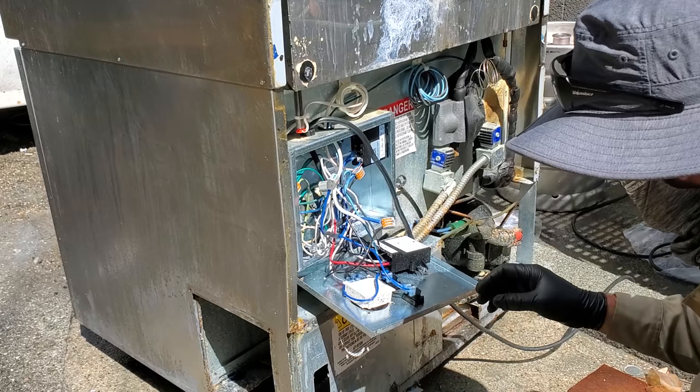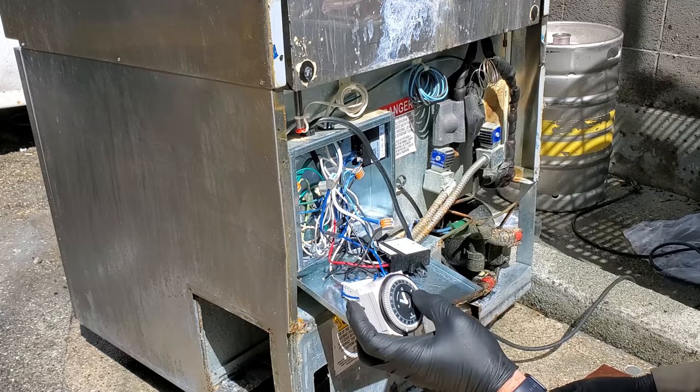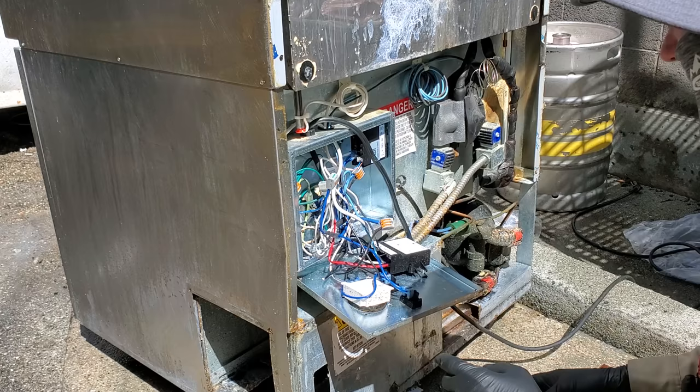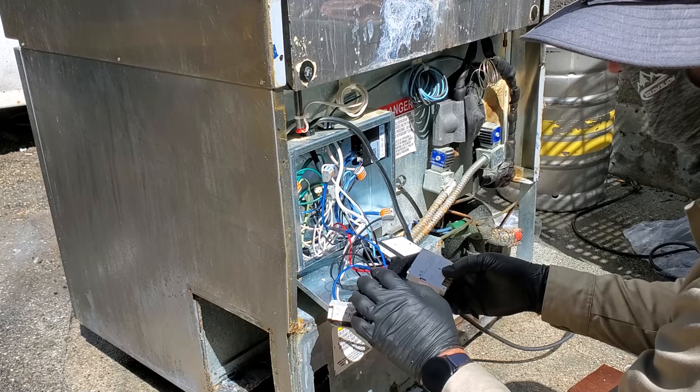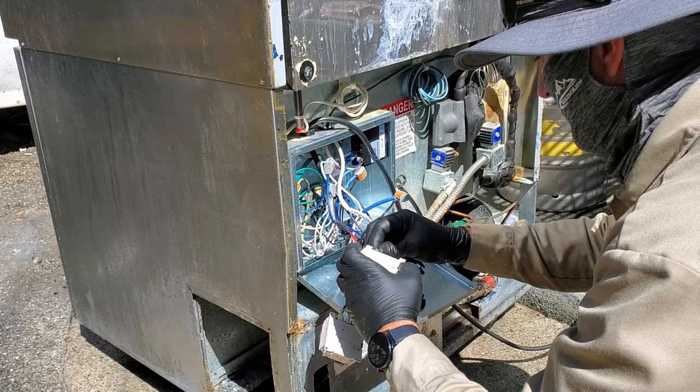So we go back with OEM parts. No questions asked when you use OEM parts. It's a Delfield timer module. It has the QRTUZ, which means it has a battery backup. So be cautious about picking up the ones from the supply house that don't say QRTUZ. If it says STUZ, then it doesn't have the battery backup. So just make sure you put the OEMs back in whenever possible. That way you eliminate any questions.